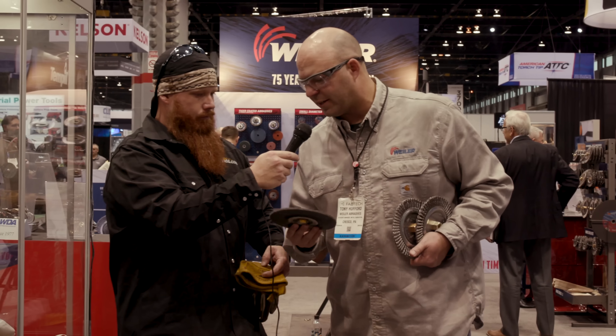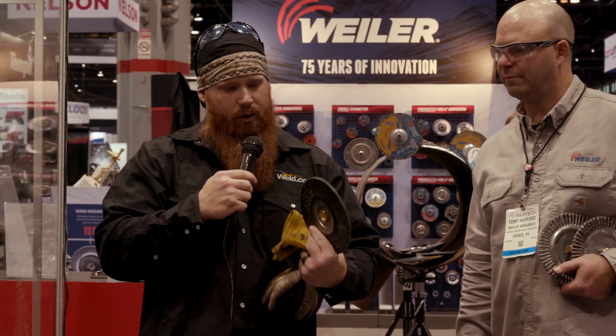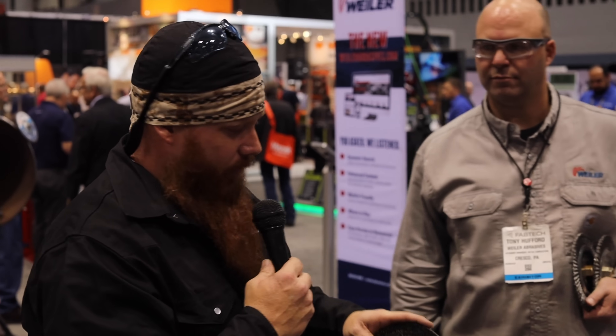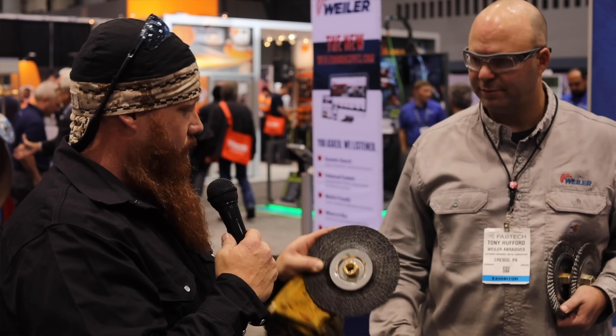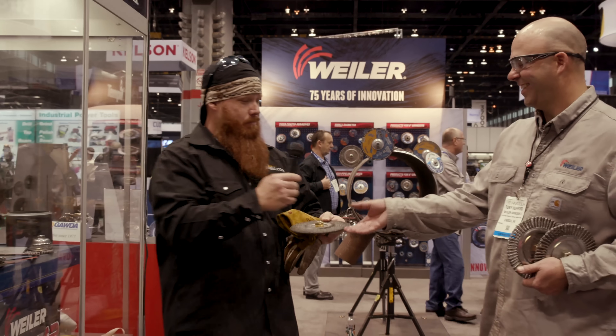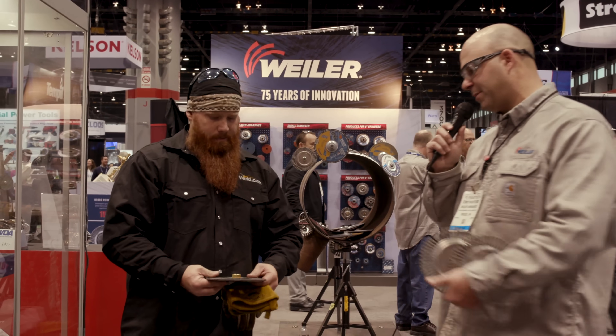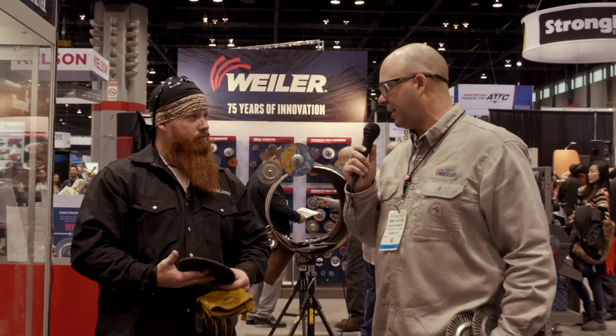Let's talk about the encapsulated wheel. I noticed this one is a lot more aggressive than I anticipated — I didn't think it was going to do a whole lot just because it's encased in a hard epoxy resin. But I think this one was probably the most aggressive out of all of them. It dug in really quick and cut the time in half. This one worked a lot better than I anticipated. You really just have to pick the right product for you. If you're going to use an encapsulated brush, you want to use it as a filler pass brush as you get through the fillers and caps. With the stringer bead, you can go through the whole thing.